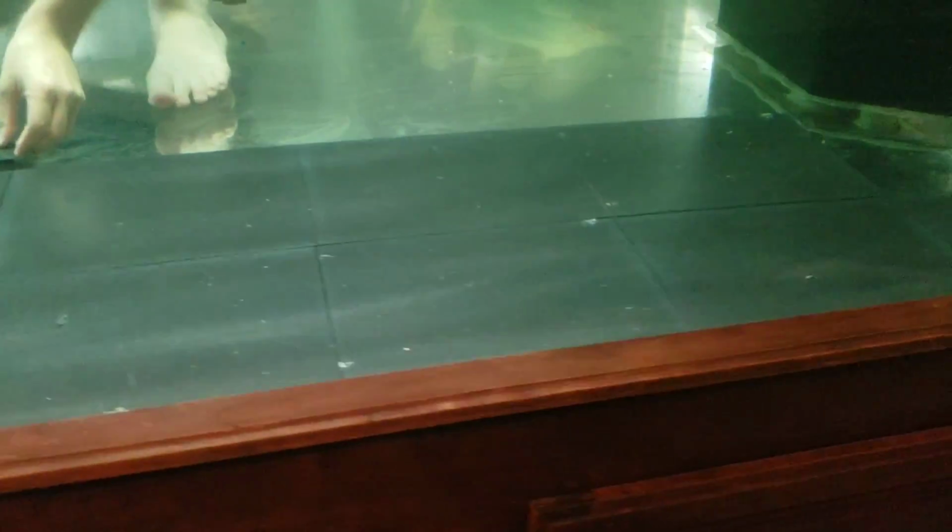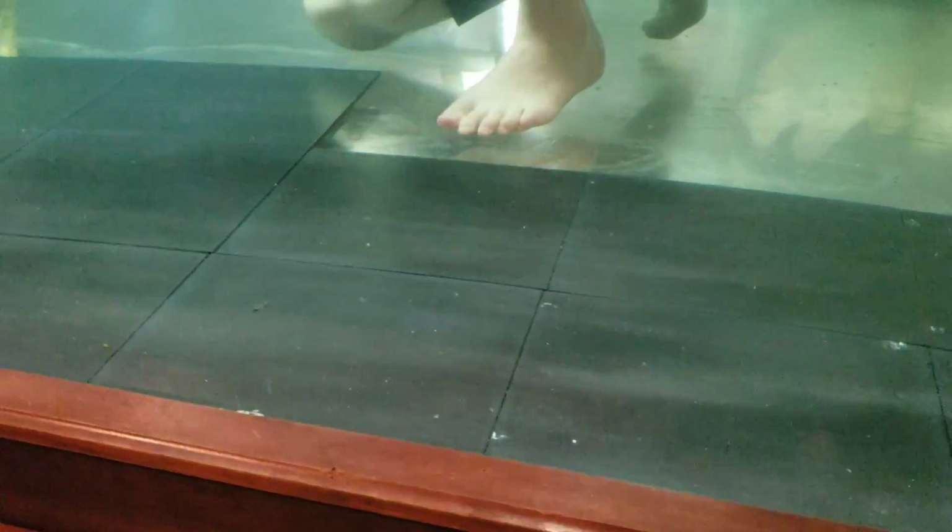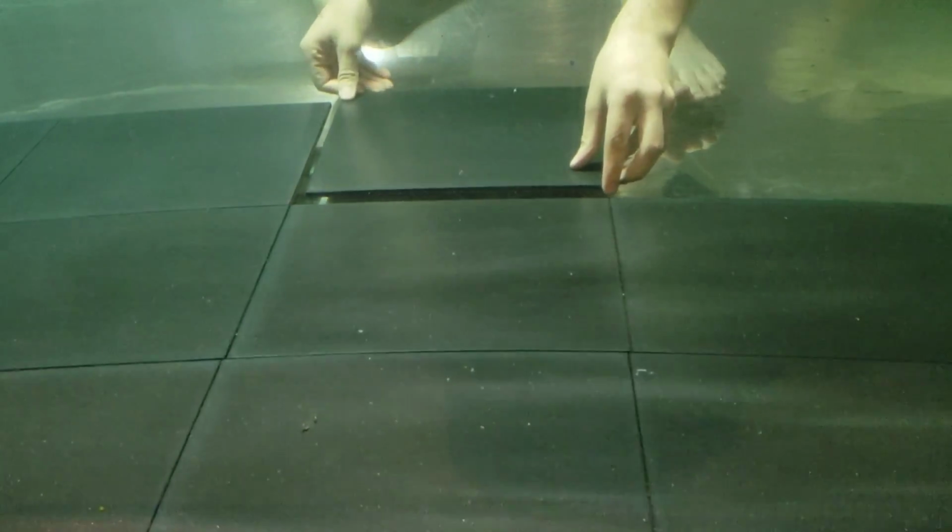You're getting that second row on there pretty good. And then we just got that corner piece to cut there. Okay, and here you see we've got 3 rows done. We've still got to cut out the edges. He's finishing the 3rd row. Got 2 more pieces, 3 more after this. Just got to clear out the dirt on each one, make sure there's no air behind it, and put the tile down.